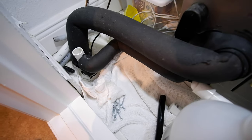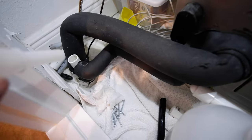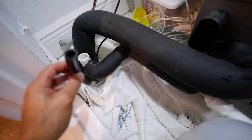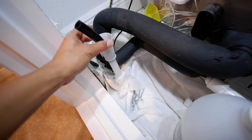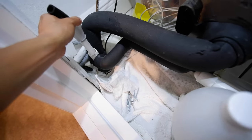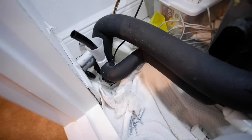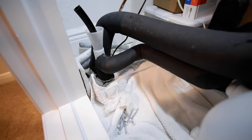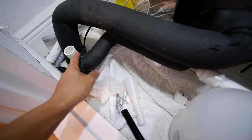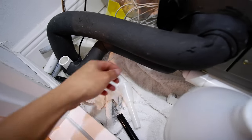With my issue over the weekend this thing was really clogged. I usually use a vacuum on the blower side to blow air out, but it wasn't dislodging anything. So what I had to do was get a little piece of tube right here that fits right into the hole, and then use compressed air — actually 90 psi of compressed air — to unclog it. For a setup like this, putting compressed air in there, you're going to need a little piece of hose that fits snugly on the inner diameter of the tube and can build some pressure. Because if you just put air straight in, most of it is going to go back into the unit and you'll have a big air gap.